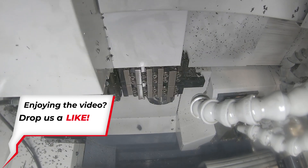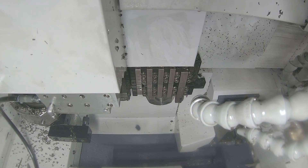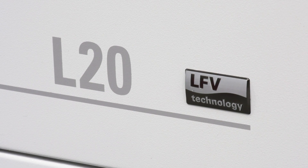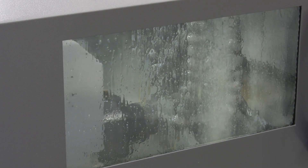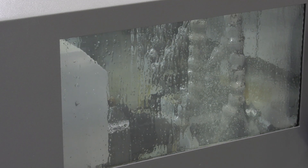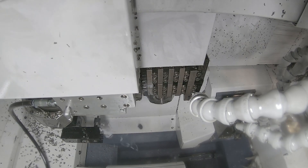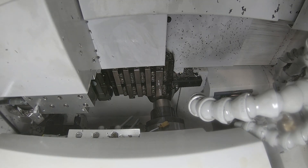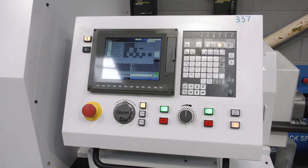With the LFV control - what does that mean to you guys? The LFV is a godsend. It really helps with swarf management. On the fixed head we had a lot of problems with swarf getting in the way of tools and messing with surface finish. The LFV's programmable chip size is lovely - if it's too long you can just change it. And being new to sliders and Mitsubishi controls, the Alcott Wizard makes changing that chip control easy. Yes, exceedingly easy - the Alcott Wizard helps with almost everything on the software side.